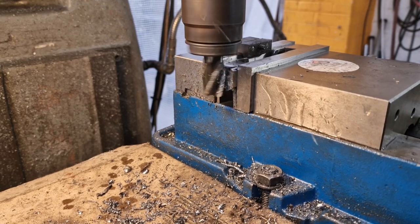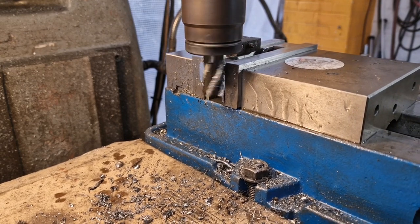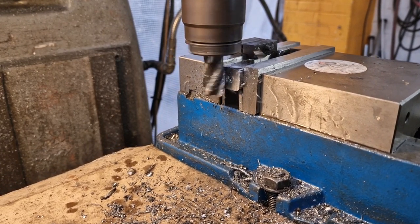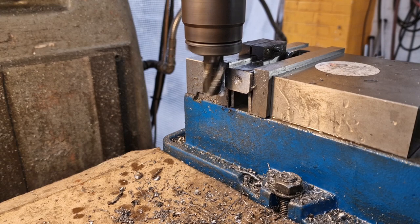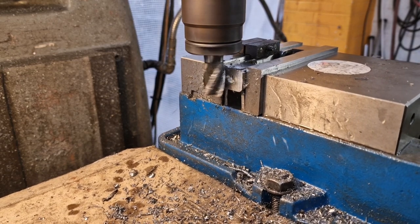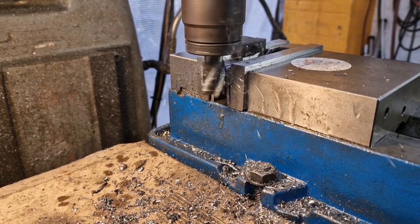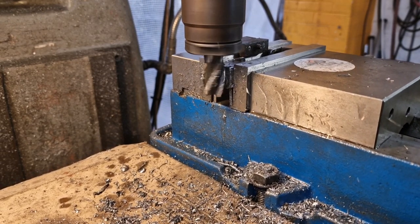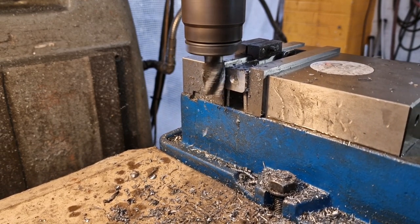I've noticed the one that had the M10 hole and thread — it's drilled and tapped M10 — it's ran off as it's gone down, it's not in the middle. I'm thinking maybe I need to go deep enough to remove that witness mark. I don't know if you can see it — you can see it there on the end, it's not in the fucking middle. Not sure I'm going to go on there. But we will probably just mill away until we get down to clean metal. I'm not sure what they're made of but they're quite tough, so we're not rushing into it.